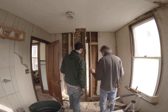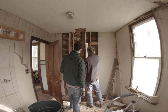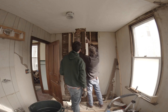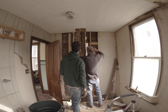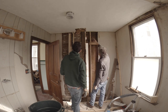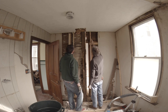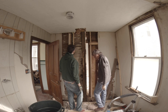Here's my thoughts on this. It's your house, think this through. This beam in terms of the roof goes like this. This is a gable end, so we just got to hold up what's above it. I think this is doing a fine job at holding that up, plus it's nailed to all the others and it's still nailed to these over here. The plumber just cut everything out, so this isn't seeing any of the weight from the weight-bearing side of the roof.